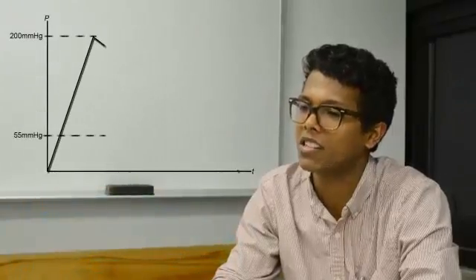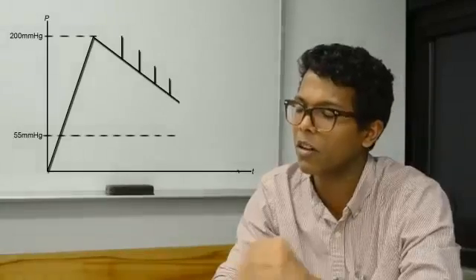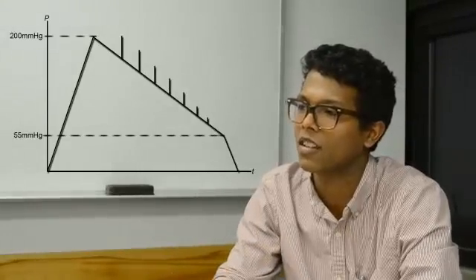What was happening with the graph was that it wasn't the typical wavy heartbeat function. Rather, if the heartbeat was strong enough, it would appear as spikes rather than waves because the sensor wasn't sensitive enough to detect everything. For the algorithm, when it first detected a peak, we would store the time for future calculations, storing each subsequent peak in an array. Once the cycle finished at 55 millimeters of mercury, that's when we did the computation.